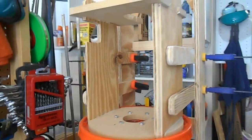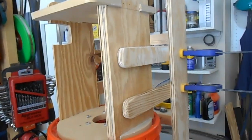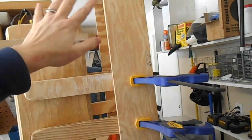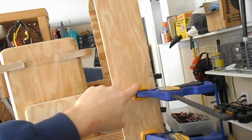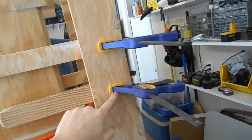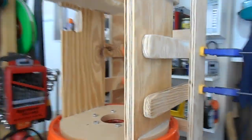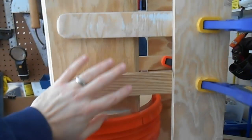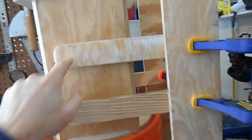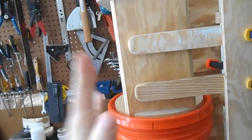Here is the full mock-up of what I've got. You can see that's roughly where the parallel arms are going to go. I wanted to sleep on this before I did anything else. I've checked everything for parallel and true as much as I can — I'm going to measure the same distance down and the same distance in for the axle holes and duplicate those measurements on the other vertical upright. The other thing I'm going to do is stack all four swivel arm pieces together, clamp them, and drill each set of axle holes in one shot so everything's accurate and I don't have measurement issues that create a binding problem.